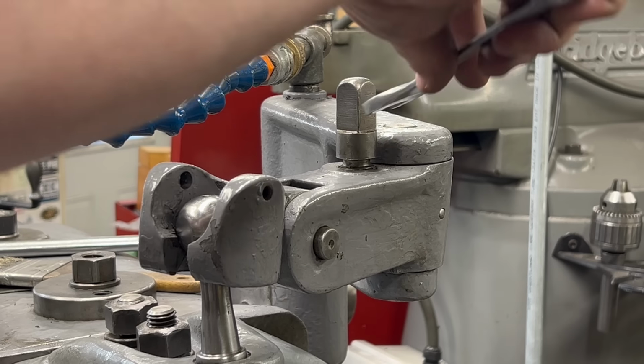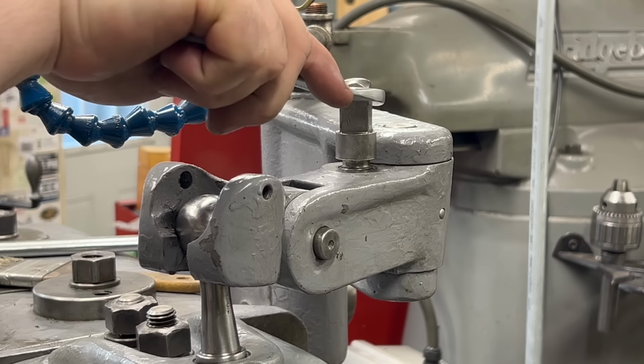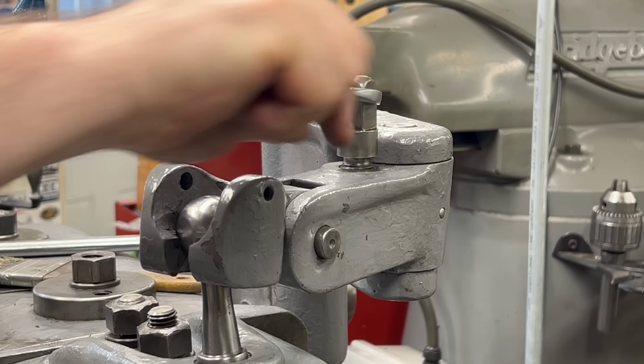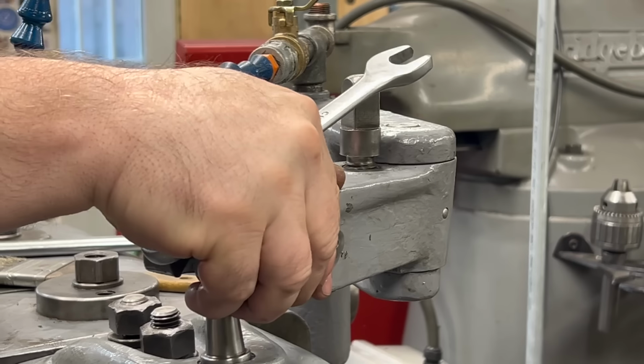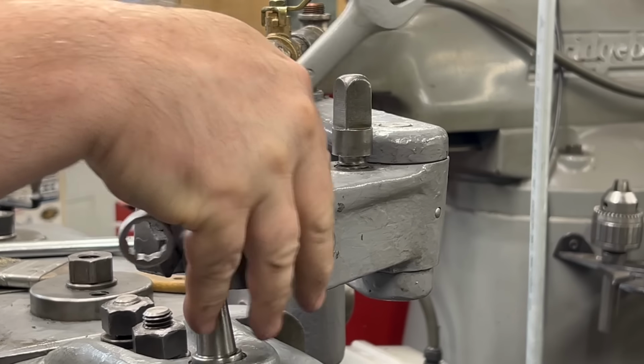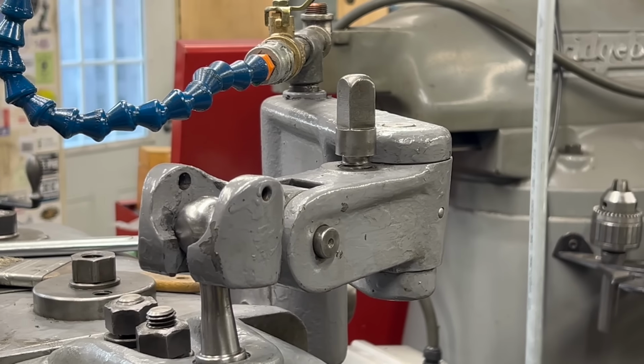Well, this screw that's on the top of the crane lets me adjust sort of the height and angle of the universal head. And by kind of giving this a little bit of an adjustment, it helps me line up those holes in the swivel support bracket so the overarms can slide in.